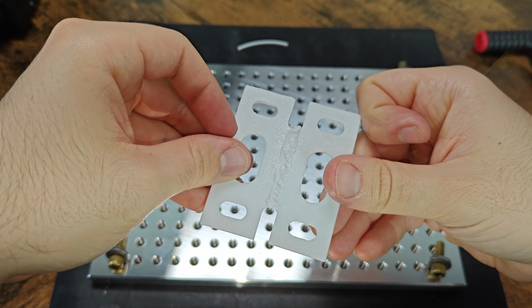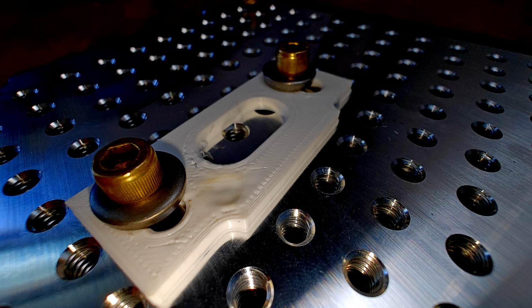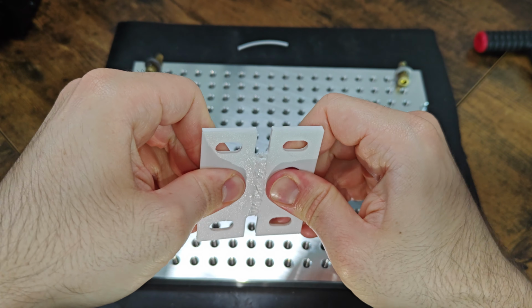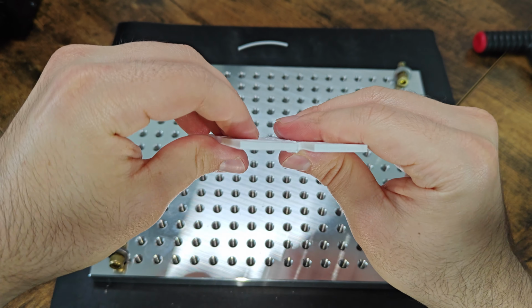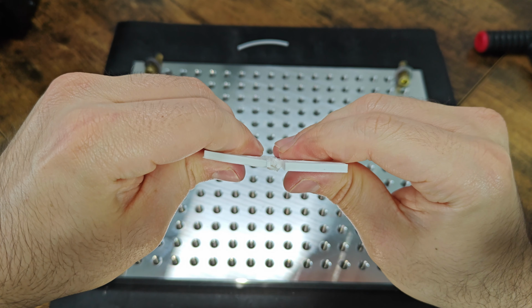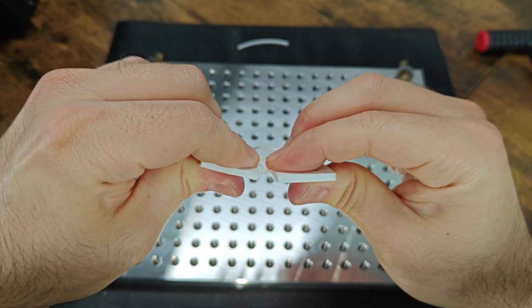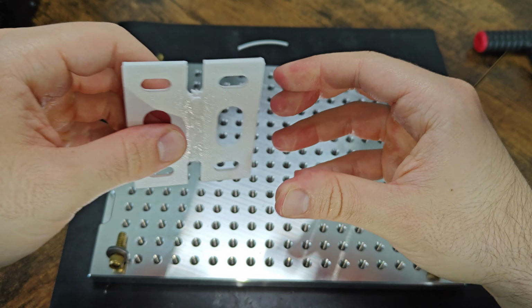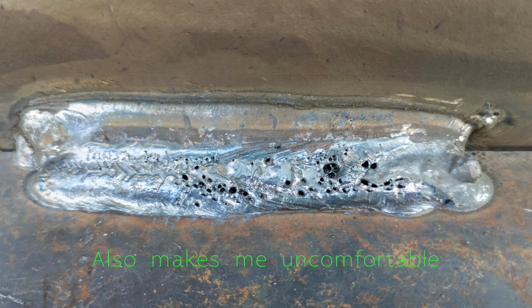There are a couple things that you want to try to avoid to maintain the maximum strength of the weld. You want to avoid burning the plastic in any way. This looks like discoloration in the plastic that is brown or black. I have once seen an oil-looking fluid come out of the plastic, but I was just able to wipe it away. I think it may just be a remnant from the filament manufacturing process, but you'd have to ask a material scientist/engineer to be sure. You will also want to avoid holes that may look like porosity in a normal weld.